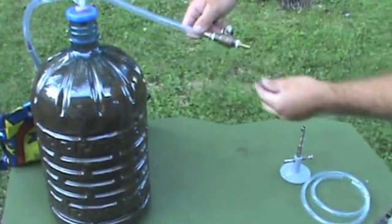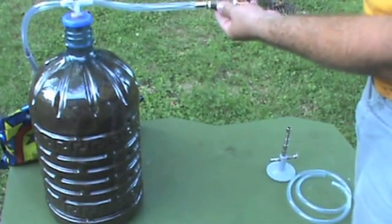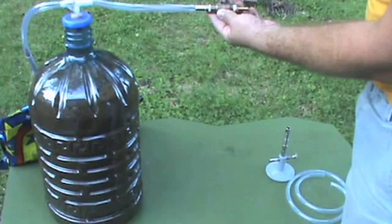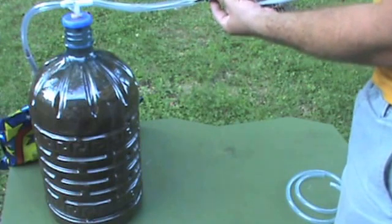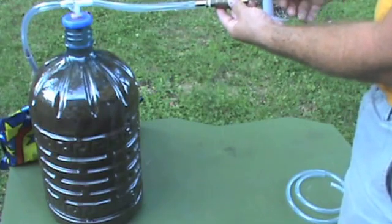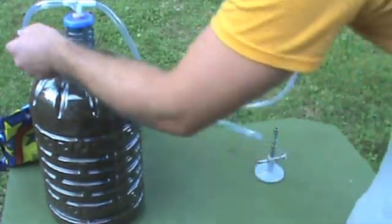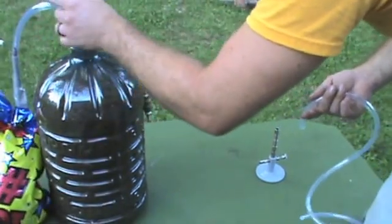The last part to add was a 3/8 fitting and 3/8 PVC because the T-valve I got was a 3/8 T-valve, so I just did that. At the barb fitting I put a 3/8 ball valve fitting, then a 3/8 barb fitting, and then a quarter-inch because my Bunsen burner from Amazon was about $11 and that was a quarter-inch fitting. Make sure you use quarter-inch. I would have just done the whole thing in quarter-inch, but it also worked out that the piece of copper fit nicely into the diameter of this.